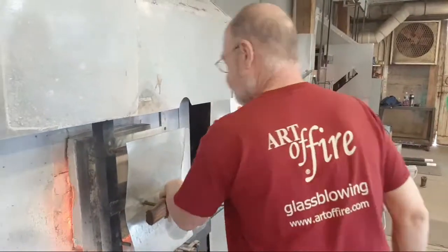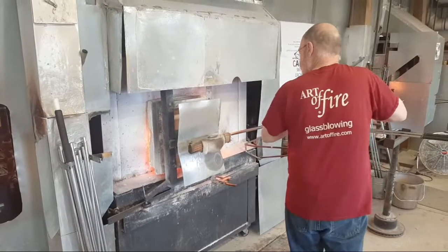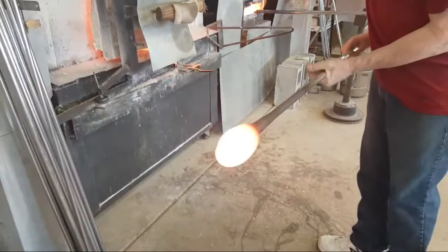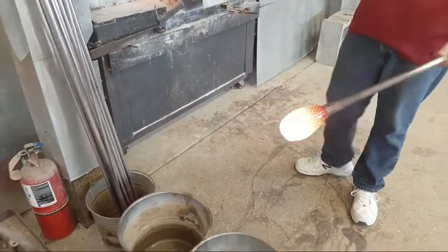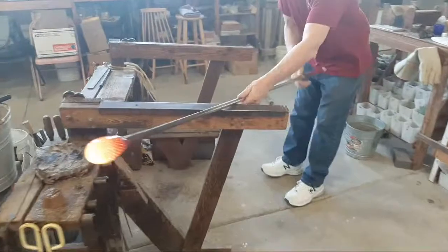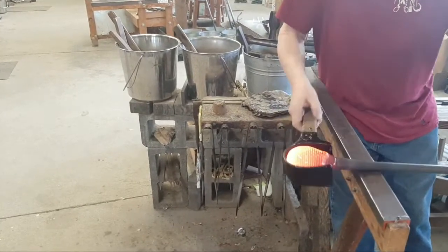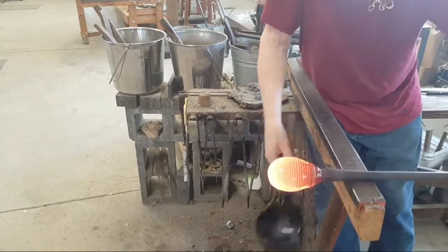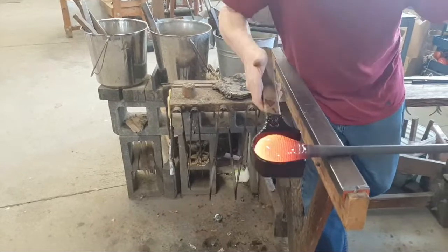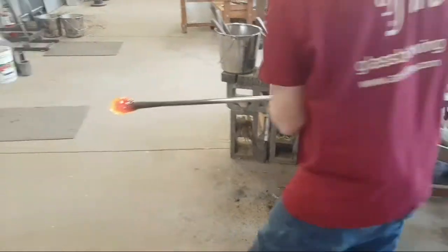He may strip it off in the furnace, but he's going to gather over that diamond pattern. By putting the glass in there and turning in the pool of molten glass, he'll bring it out. Once he brings it out, you'll see the bubbles already forming — and there they are. Everywhere there's a diamond in that diamond pattern, there are now bubbles forming. The air trap bubble is in each indentation point.